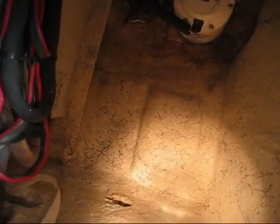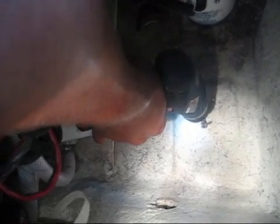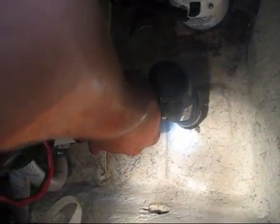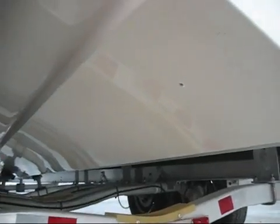And now we'll check out the bilge to find a good spot to drill the pilot hole. So here we are at the bottom of the boat, and lo and behold, our pilot hole is in the perfect spot. We actually had it all planned out the whole time. So now that we have our pilot hole, next thing is to use that hole as a guide to start our 2 3/8 inch hole to mount the transducer.